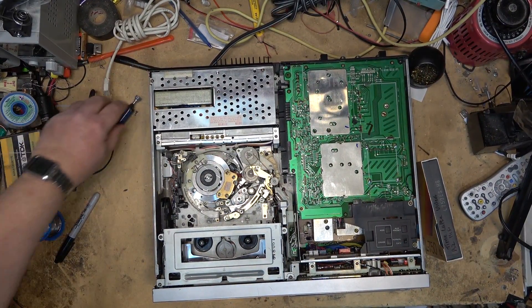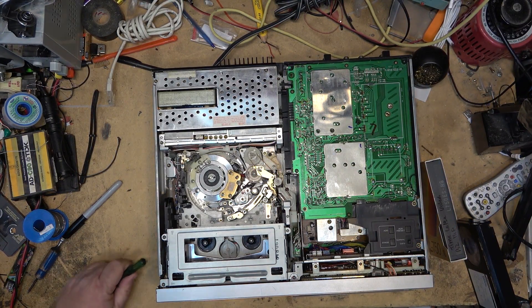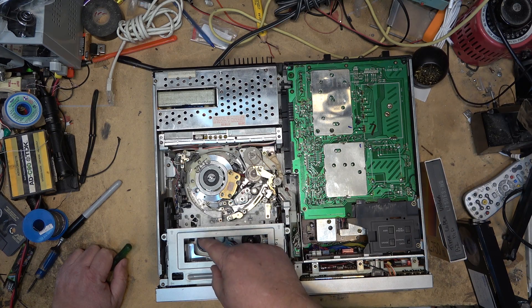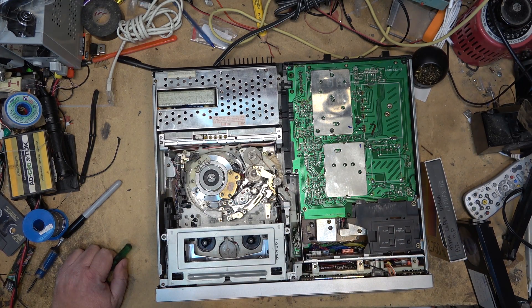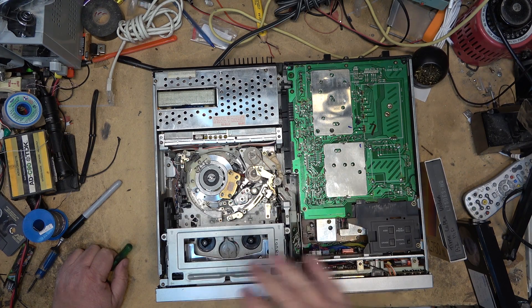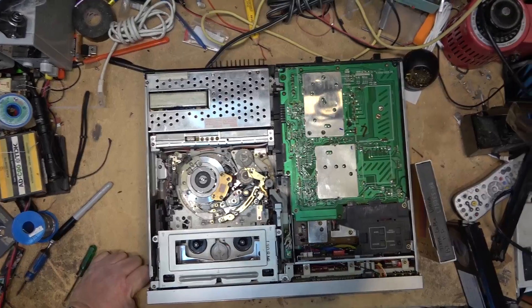This is a quick video on Sony Betamax - this is what they call the 711b chassis, which was one of Sony's most common chassis. They had the 710 chassis, used in the SL-5000, 5010, 5020, SL-5200 series, which used a loading arm that pulled the tape out with a single arm. Then they came up with the 711 chassis, used on the 2500, 2700, and SL-2000, followed by this 711b chassis, then the b2 and b3. By far the most common Sony chassis.